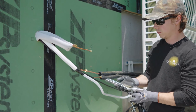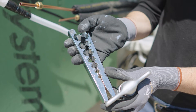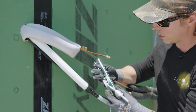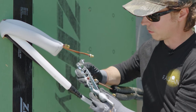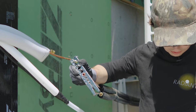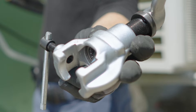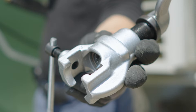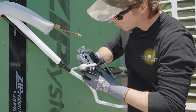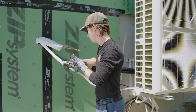When you put on the flaring tool, it shows you each individual size. Today we're using three-eighths and quarter-inch. You want to leave roughly the depth of a dime sticking out of the end — that gives you an even distribution of the copper. There's an arrow on the proper side of the tool that you want to make sure lines up with the hash lines on the actual sizes before you tighten it down.